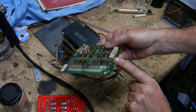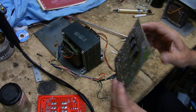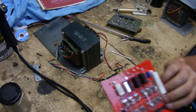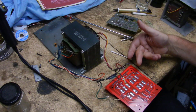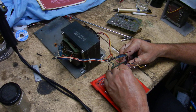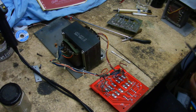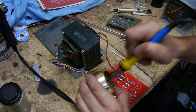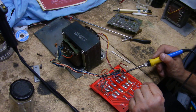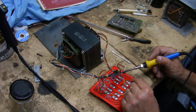So we've got the new board. I'm going to start from the bottom and work back up again - reverse order basically. I'll start off with the blacks, shove them into their holes. Get the solder, clean your tip with a bit of this, sticking in the hole. I'll put a bit of solder in from the side and let it flow from the rear to the front basically. Put a bit of solder there.